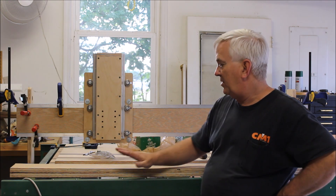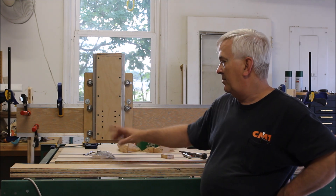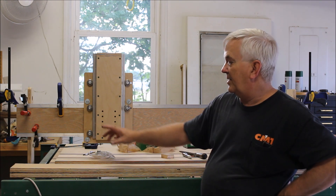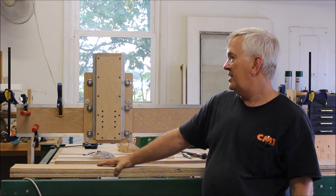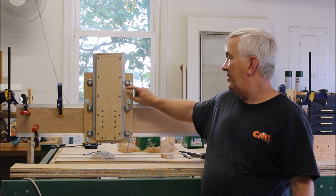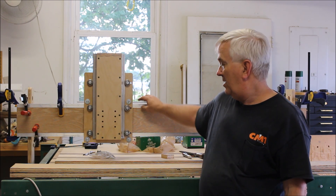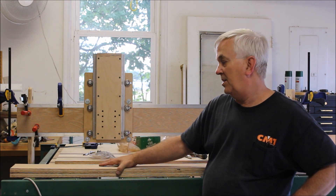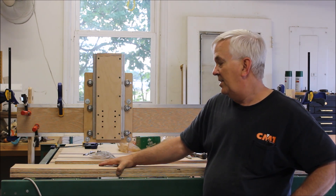This design is going to be really easy to modify and make wider because you'll be cutting the pieces yourself on a table saw. This particular one I've got set up on an old frame, and the rails on the side are a little different, so I can already tell I'll need to make the sides two to three inches taller. On a regular table the design won't change much. The main change is standardizing the rails — before the z-rails and x-rails were three-quarter by three-quarter by one-eighth angle and the table rails were one inch by one inch by one-eighth angle. Now I'm making them all three-quarter so you don't have to buy two different kinds of angle.